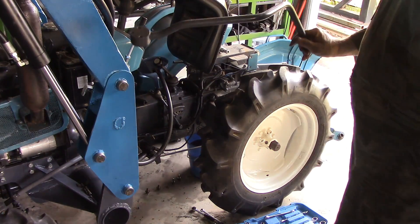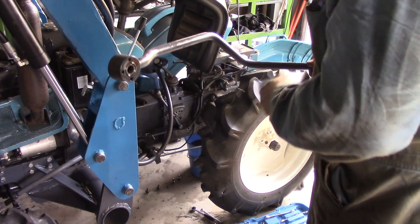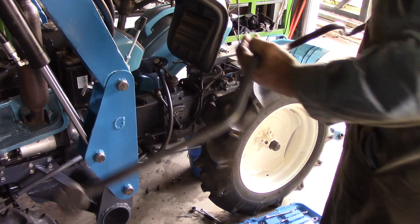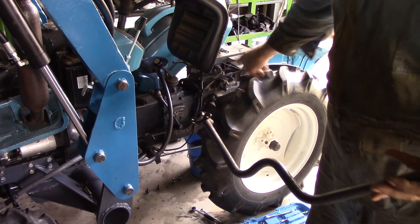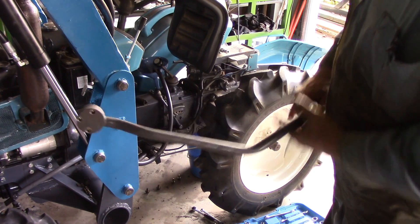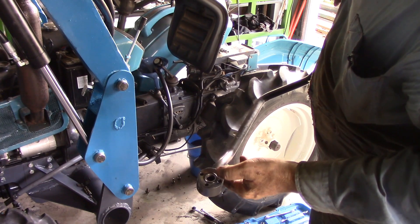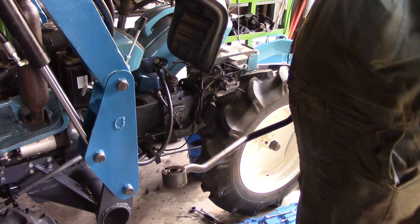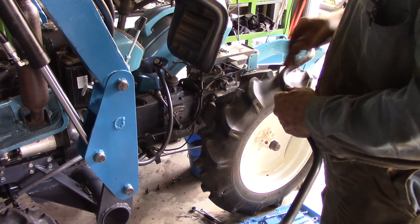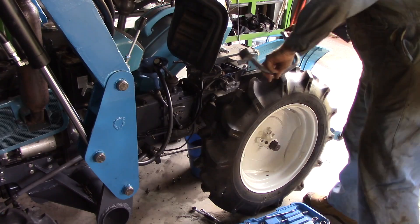There it is — out. I've still got my mark where I want to put that fitting. There's an O-ring around this where it goes into the back of the tractor and another one in the front. So just be careful you don't lose them. I'm going to get them out and put them somewhere safe until after I've finished welding.